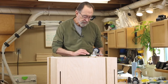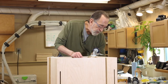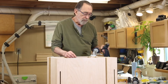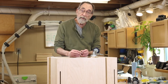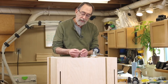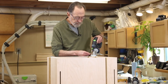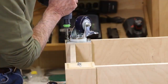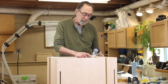What I did was I put the caster in place, got it centered where I wanted it, and marked the hole locations. Then I drilled a 7/64th inch pilot hole about an inch deep into the material. I'm using number 10 round head screws — actually sheet metal screws — but they're going to work just great. These are an inch and a quarter long, and I'm just driving them in. If driving them in gets a little bit too tough for the driver, I also have a regular manual screwdriver to come around and tighten them up.